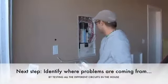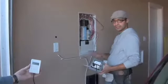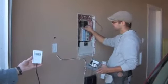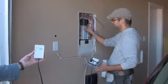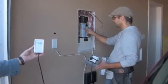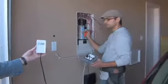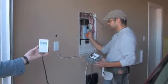So what we've done here is isolated the entire house, and we're going to turn on one breaker at a time and see what kind of effect it has on the overall GS units put onto the house and on that individual circuit. So turning on that one does... Still at 100. 100. 170. Drop down to 135, 188. 267, 300. Okay, so that one's a high one. Which one is that? I'll look at the schedule afterwards and determine. I'm going to put a mark here on that breaker. Yeah, that's running right at 325. Jump to 490, down to 135. 98.